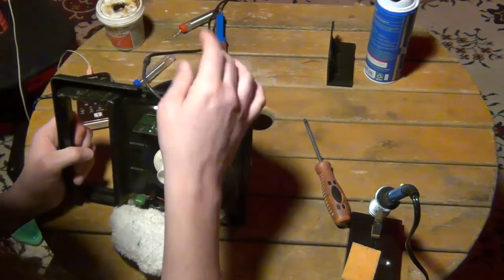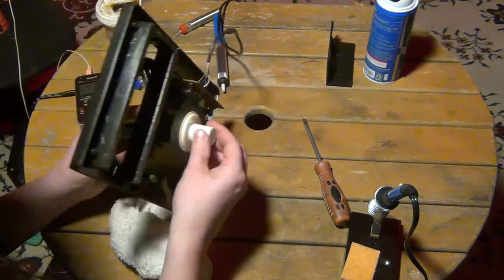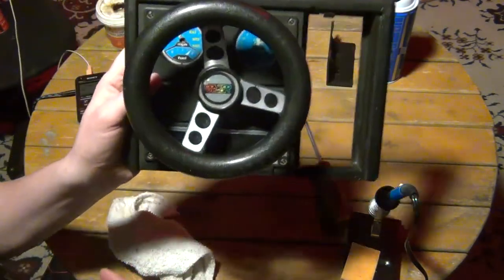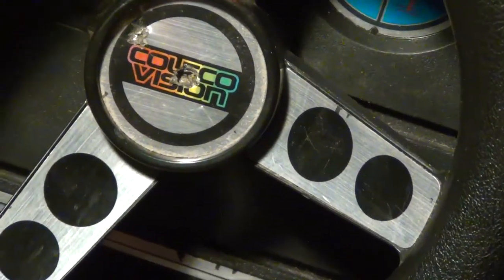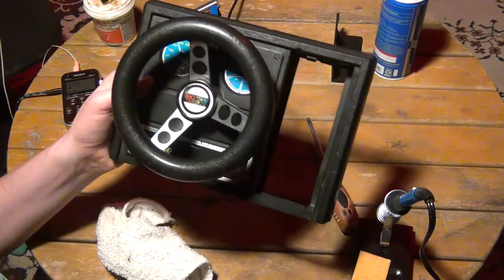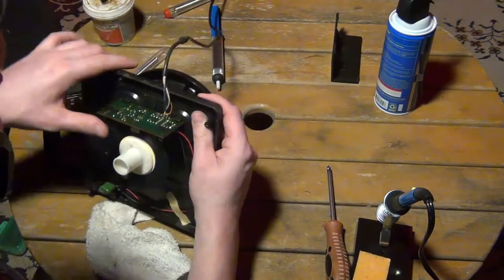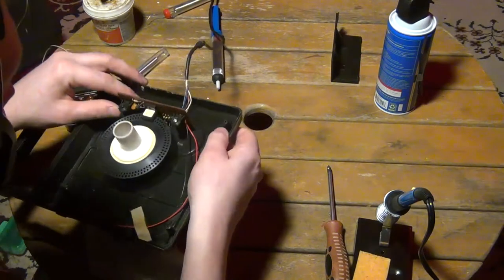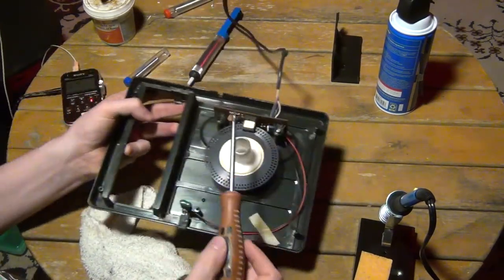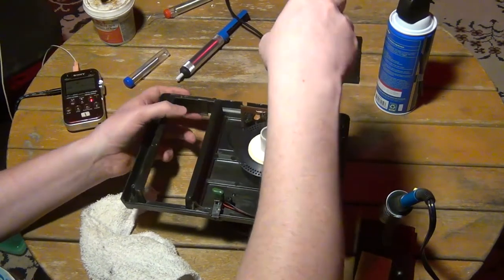Now I am not going to be desoldering this to get this out of the way, because that's going to be a lot of dinking around trying to re-solder all that junk back into place. It looked like somebody had already got torn into this, because somebody had already poked the hole in there and tried taking the screw out. Obviously this has been acting up before, and they did not do a good job fixing it - hopefully I can do a good job fixing it. This whole board feels kind of loose and these wires are running under there. The screws in here should be holding this nice and tight, and I almost wonder if maybe the screw just wasn't tight enough.